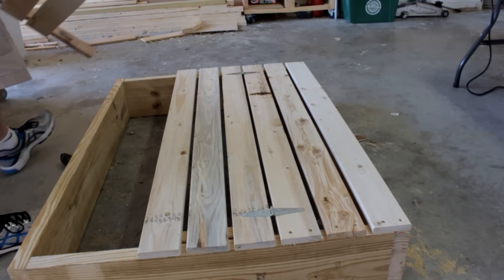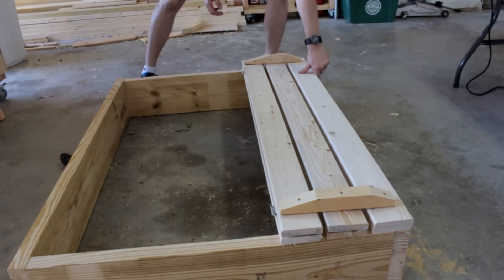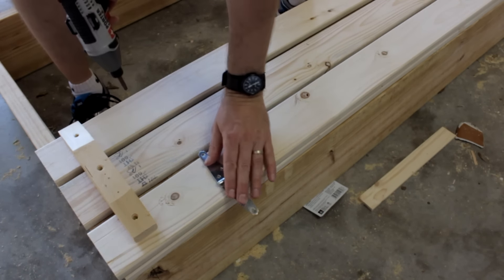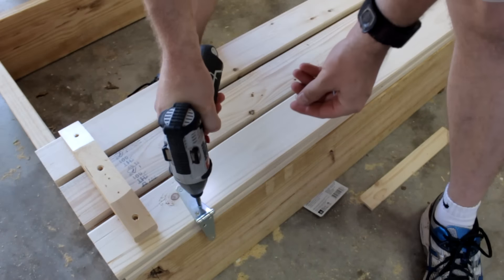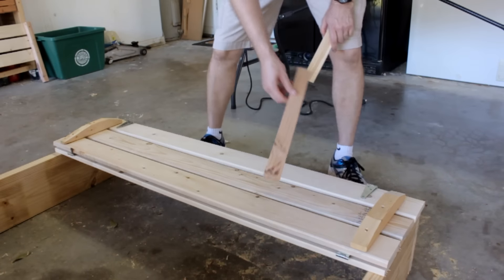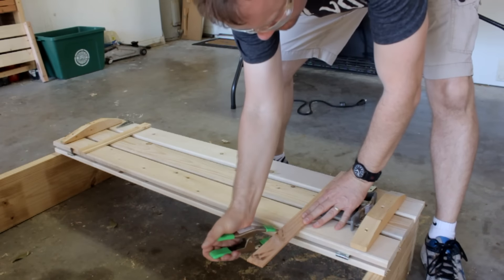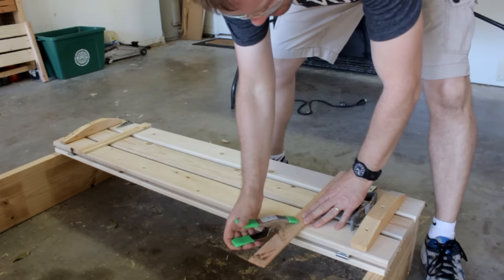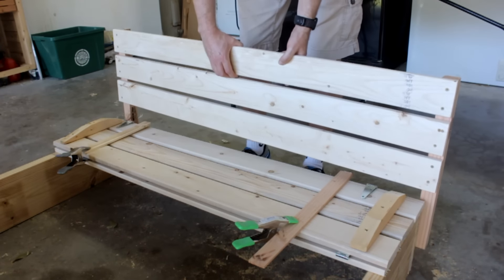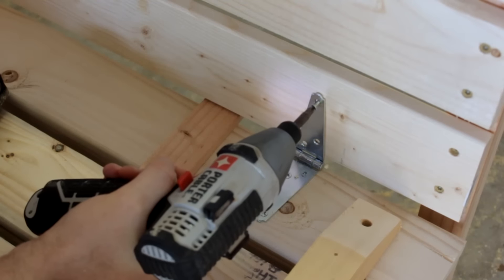I'll remove that section for the time being and set it aside. Flip the second section over onto the first so that I can attach a couple more hinges — just make sure the knuckle of the hinge is overhanging the boards. Now I'll fold those back on themselves. Spacers are handy dandy things; these are quarter inch, maybe a little bit thicker — about the thickness of the knuckle on the hinges is what you're going to want. Place those so they are overhanging the back, then set the final section on top of the spacers. Now the hinges can just be flipped up and attached.